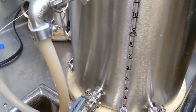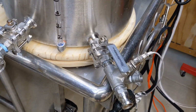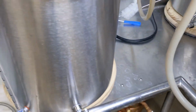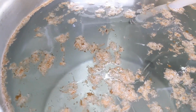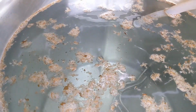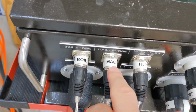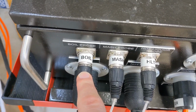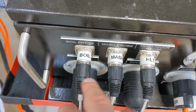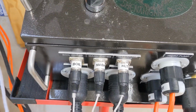So I just went ahead and I ordered two probes. Those are the 1.5 inch with half-inch MPT threads, and that one in the back is a 2 inch with M14 weldless connection. So now I've got something just in case. You've got to have something just in case, right? But I switched this cable with the boil cable. Same with the RTD, the probes, and yeah, it's definitely the sensor. The cables, everything's the same regardless of which cable I'm using. So yeah.